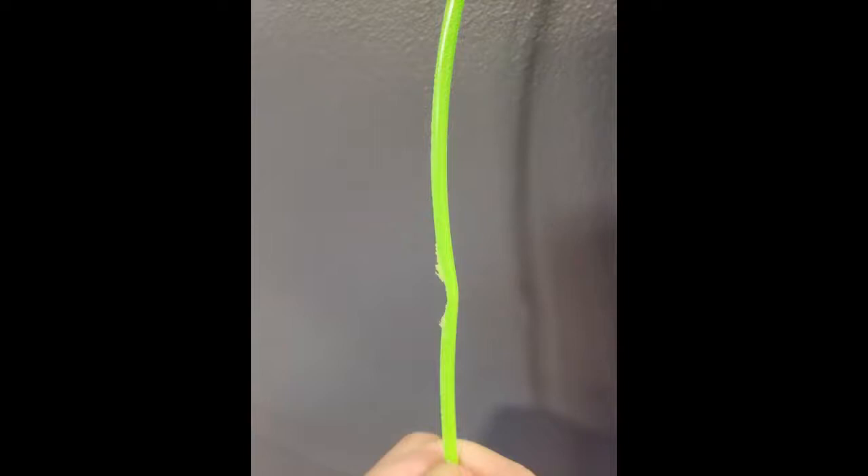This is what normal filament should look like. As you can see, it's all one solid piece, so it's going to be pushed through the Bowden tubes into the print core. This is what a grind-out looks like. As you can see, the filament looks like somebody took a bite out of it. This is because the wheel in the feeder compartment just kept trying to push this through the Bowden tube, but since the filament wasn't moving, it just ended up chewing a piece out.